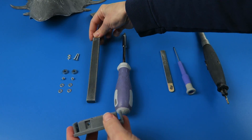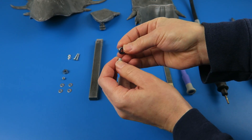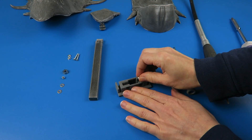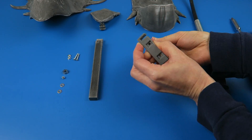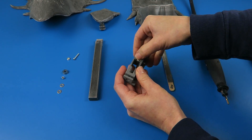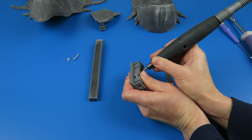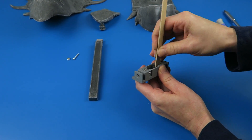I got the track all smoothed out, removing enough epoxy to get a perfect fit between the two parts. I need to add some hardware — a small 3D printed adapter that fits into the bearing, with washers for each side, all screwed into the horizontal bracket. The model is designed with very tight clearances so it can be sanded down to a perfect fit depending on the exact size of the washer. One side needed a bit more sanding with a small Dremel bit and a sanding stick until it had a perfect fit. The pieces need to fit tightly so they're not sloshing around.